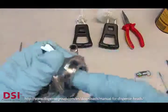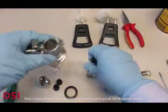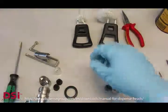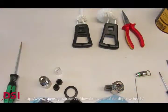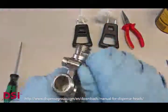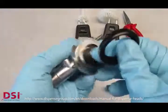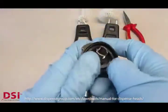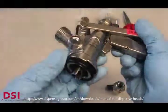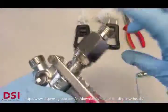That's necessary because there is a movement between body and piston, and residues of beverages can stick both things together. Then we bring the handle back to the coupler by hand tightening the screw. That should be good enough. Then we reassemble the CO2 main sealing at the body. That's a little bit tricky. As mentioned before, there is a very tight seat, but after assembling 2 or 3 of them, for sure you will know how to handle it.